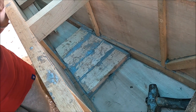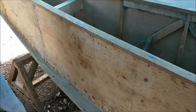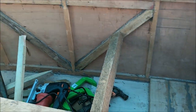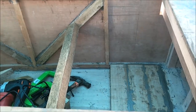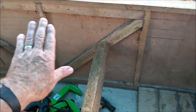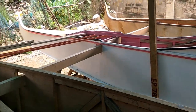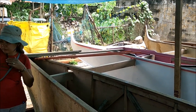That's what we do ultimately to the sides and everywhere — thin it down with lacquer thinner only, not any other kind of thinner, and then smear it on as a very thin coating. On a vertical surface it's going to try to run down. Anyway, we're going to go get some lunch and we'll be back with more primer and building from my paradise on Batilian Island.